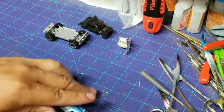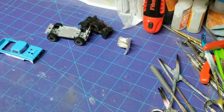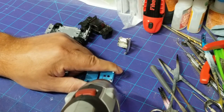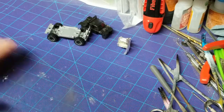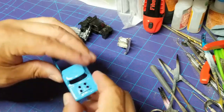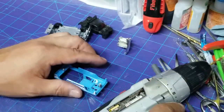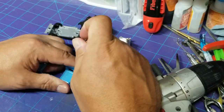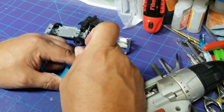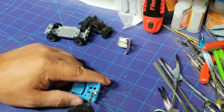I like doing this part starting off with the drill bits because it takes a good amount of material away. That definitely limits the amount of cutting and filing that you've got to do, which can be a bit of a pain, that's for sure. But I've got all my corners drilled out. So I'm going to center punch to try to get a couple more holes in there to eliminate a little more of that material, so I don't have to try to cut it or sand it.